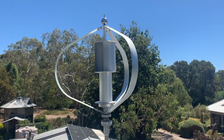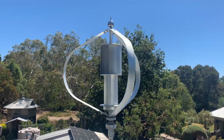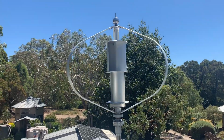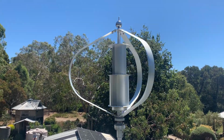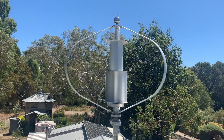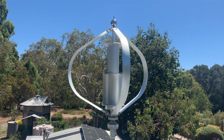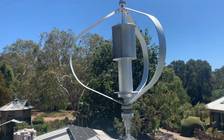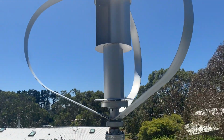Just thought I'd do a quick two-yearly review of this Typmar branded, Chinese built vertical axis turbine. After a year of testing, I have found that this thing is certainly not outputting its stated 400 watt output. The most I've ever seen out of this is 250 watts, and this is with it absolutely caning, spinning at a massive speed. It simply doesn't output the 400 watt factory claim.